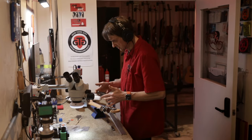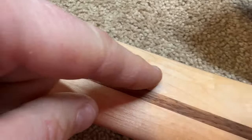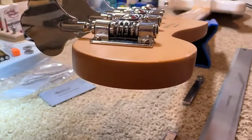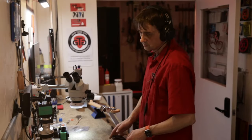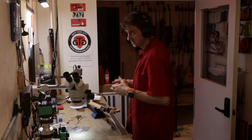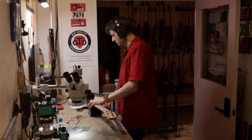As you can see, the growth rings are wrapping around this side, and here we only see the lines. This means the grain is slanted — at an angle. Sometimes that means the neck might twist or do something we don't want it to do as it ages.